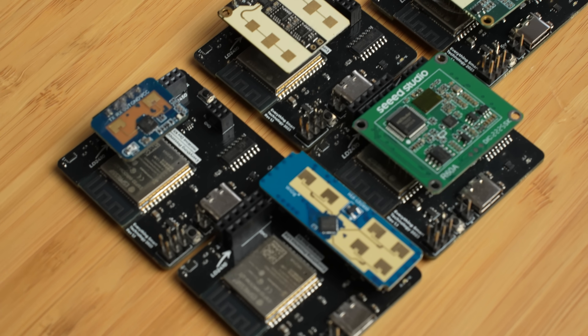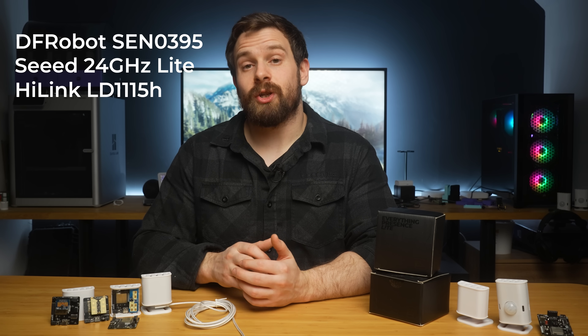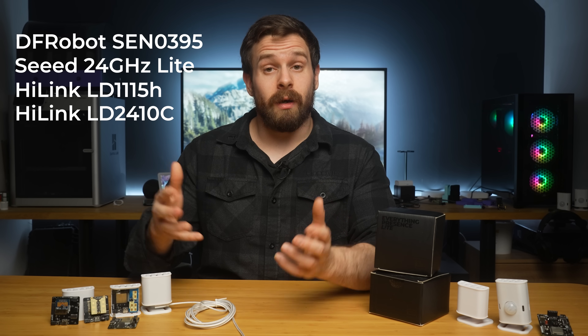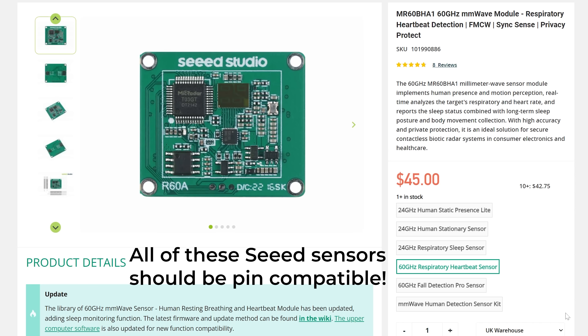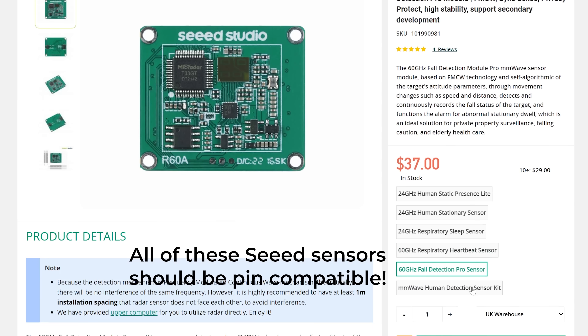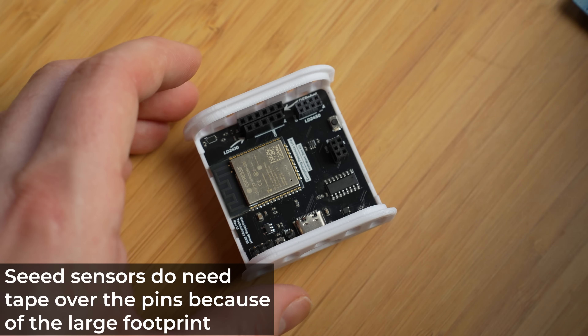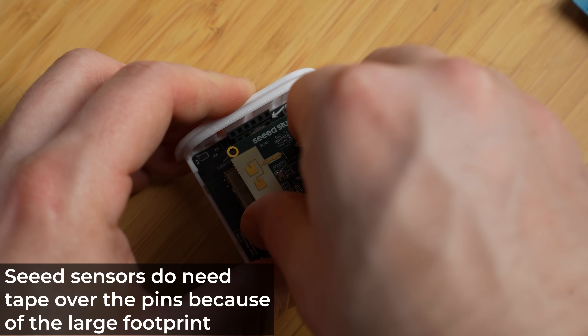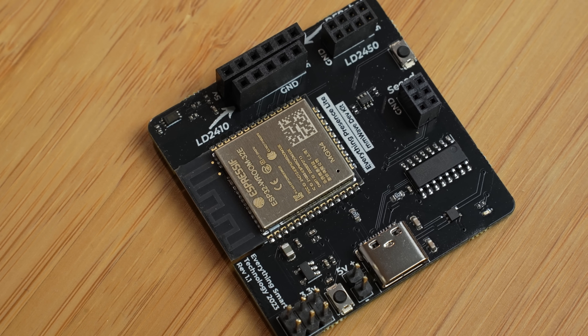We made the Light compatible with five different sensors: the SEN-0395 (the DF Robot one used in the EP1), the Seeed millimeter wave Light, the Hi-Link LD-115H, the LD-2410C which is really popular, and the LD-2450 which is the one we ship by default. It's also pin-compatible with other sensors like the Seeed 24 GHz, Seeed 60 GHz, and various other Hi-Link sensors, though I haven't tested the software on those yet. So if you want to monitor heart rate instead of zones, for example, you can swap in the Seeed 60 GHz heart rate module — and if a new sensor comes out in the future, there's a chance it can be swapped in too, unlike if it were soldered directly to the board.